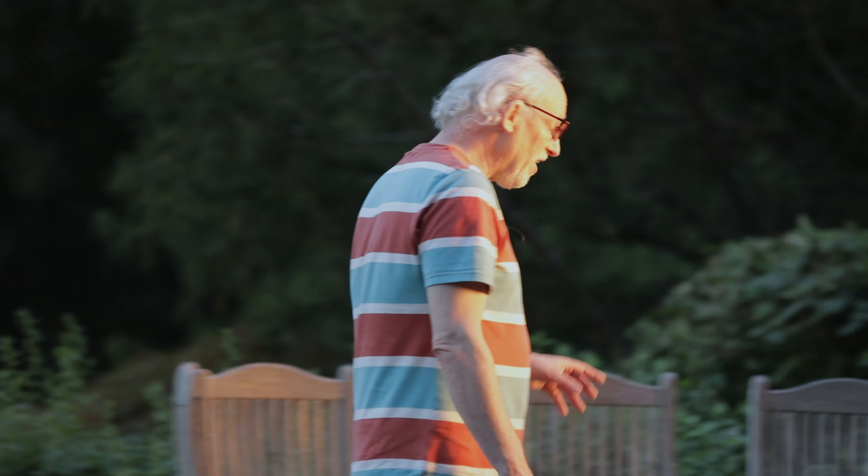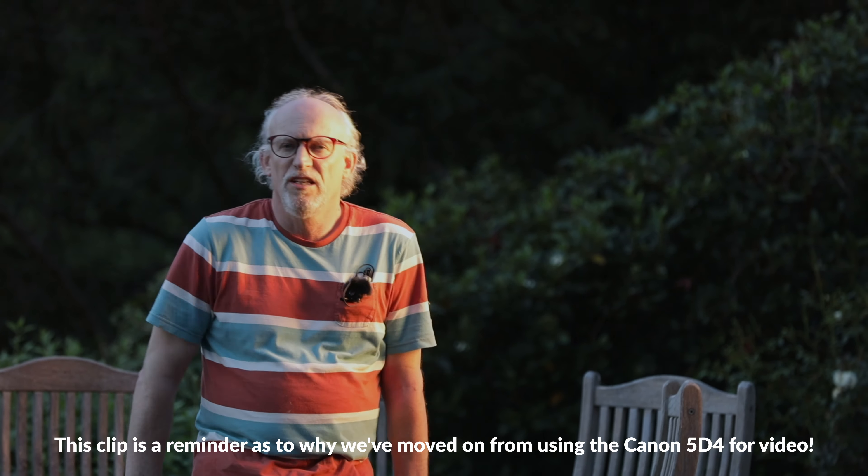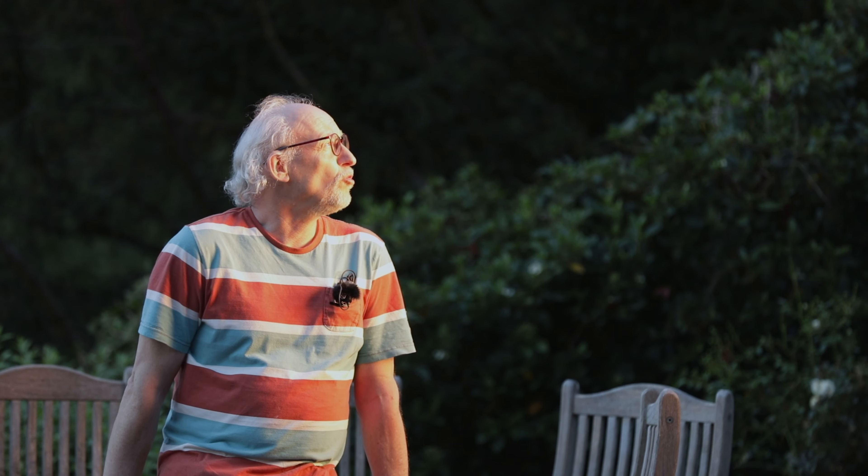This leads us to some conclusions about the way the Comica constructs and sends its data to the receiver. The conclusion is that the data is put into multiple packets that are shifted across the frequency spectrum, and the receiver reassembles them. That's why it isn't disturbed by the reasonably RF-aggressive tests we were making.